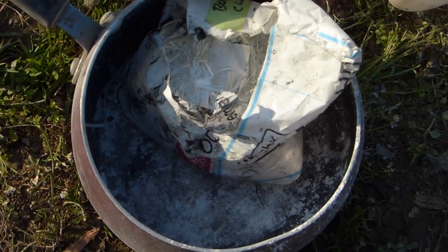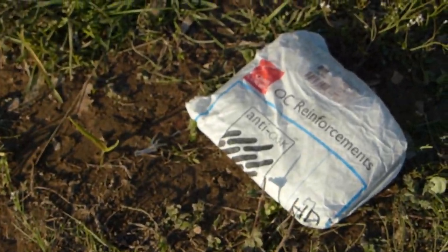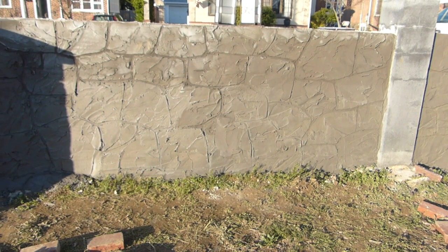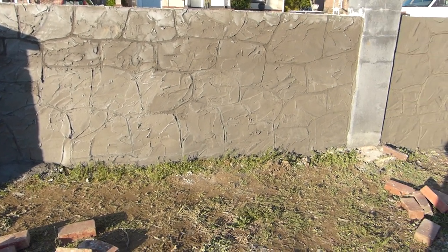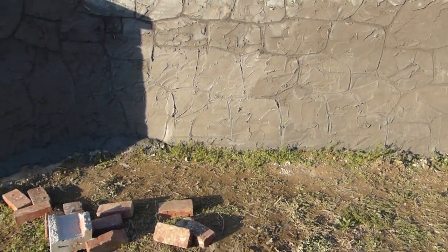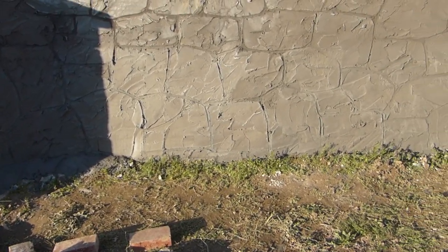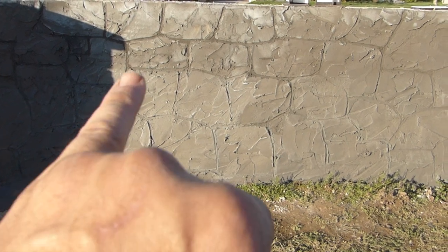There's the fiberglass — it's Owens Corning, just a bag of reinforcement fiber. It really helps with cracking. If you don't do it, you're more than likely going to have cracking issues. If you just stack the block and try to use regular Portland over the face of it, the fiberglass really acts as the tension resistance and bond.